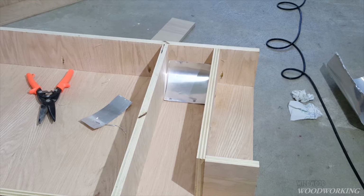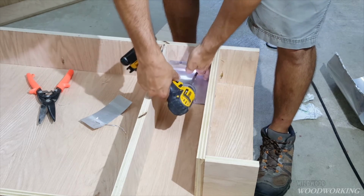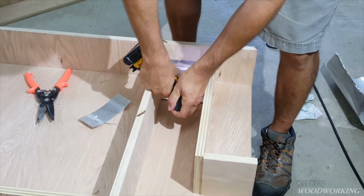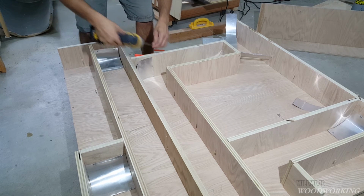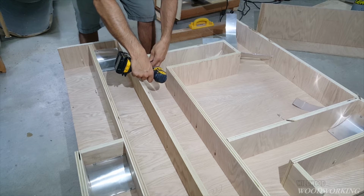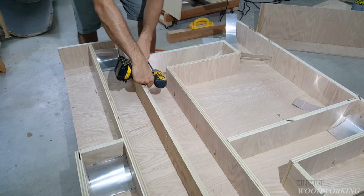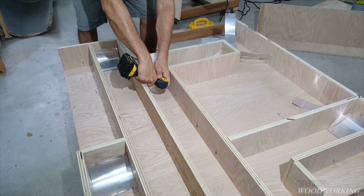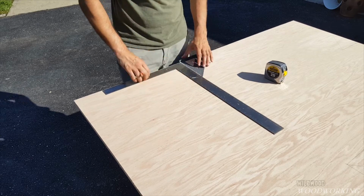Now, because I'm working with air that's moving about 1200 CFM, at those speeds, air acts more like a water, like a liquid fluid. So it needs some redirection. This isn't the best way to do it, but the tin definitely helps. It's just regular roofing flashing. I'm expecting to lose about 100-150 CFM on these turns, since it's the last turn before the tool. It wasn't going to be a big deal since I was measuring 1200 CFM at the dust collection port.